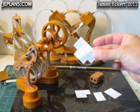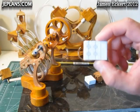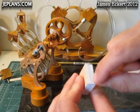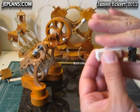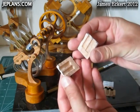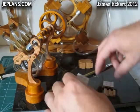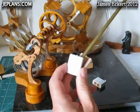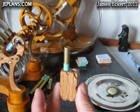There are a couple more pieces we are going to build for the air bus — basically the parts that take the air in and out. These are the blocks prior to cutting anything out. I am going to cut each in half, put it in a vise, drill them out, then glue it together over the tubes. I actually drilled them out first, then cut them in half, then re-drilled them. Now I am going to cut the tubes, glue them in place, and get everything assembled.